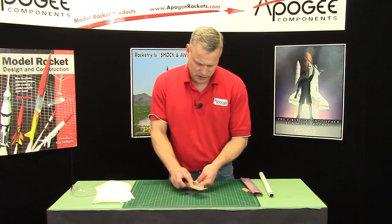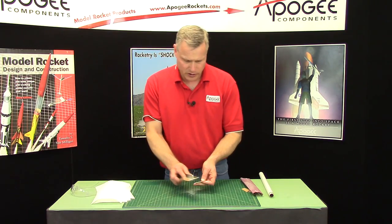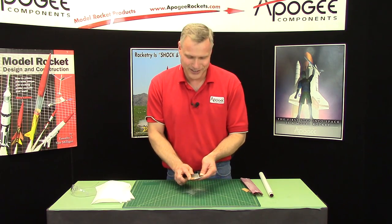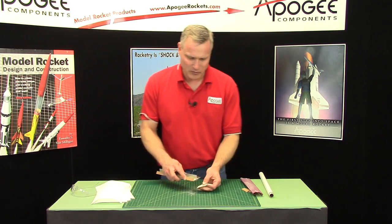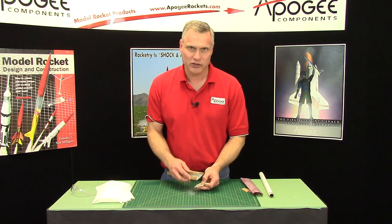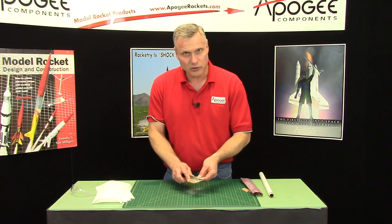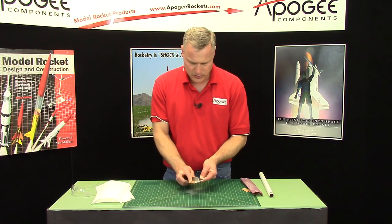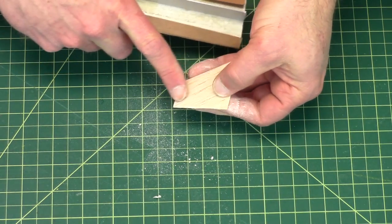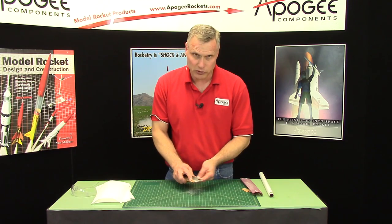And go back to work. If you can feel it with your finger, then sand it off — it means you're not done sanding. You can also apply another coat of the super glue on it. Usually the second time you put it on, it's starting out pretty smooth, and so you'll get a really smooth fin. And if you sand through the super glue — you can tell by looking at the color — go ahead and put another coat of super glue on it.